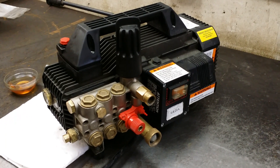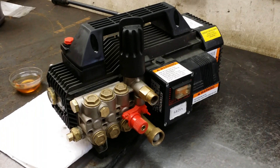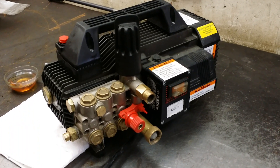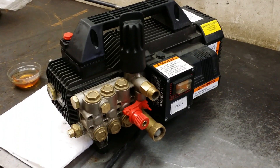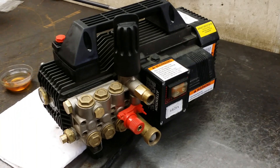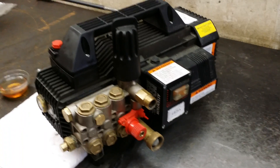We've received several calls during the spring of 2014 regarding the rebuilding of a pressure washer pump that had been leaking water for some time, and the water had eventually made its way back into the crankcase and contaminated the oil, resulting in a pump failure. We felt a short video would help explain what happens when the oil is contaminated. Today we received this 1500A pressure washer in for evaluation, and it has the telltale signs and is a good example of oil contamination.